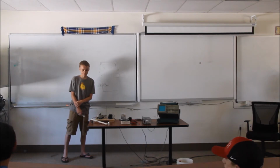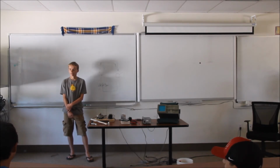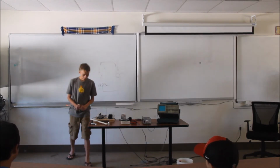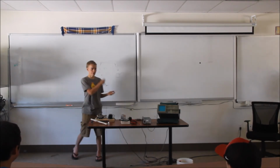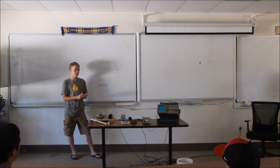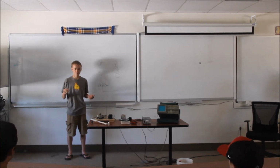So, current, it's the opposite way that the electrons are flowing. Yeah. So, why is it? Why? Well, I'll get to that later in the class when I explain transistors and diodes and different things that show current. But the reason that current flows in the opposite direction of electrons is pretty much to make it easier for anybody who's reading a schematic diagram. Oh, okay.